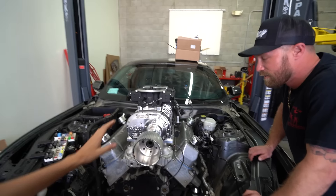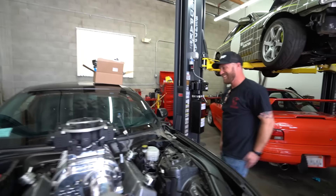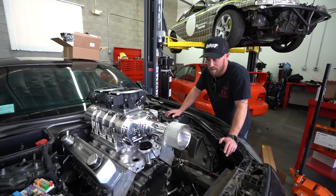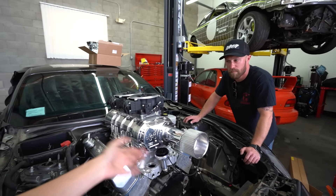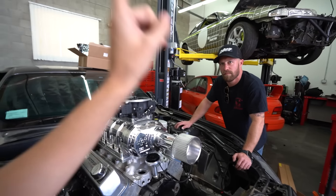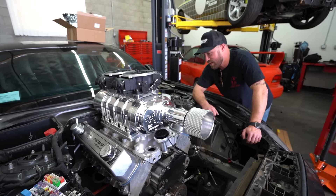This is not sus at all. I've grown to really love and get so excited for this build, and I realized I just don't like stock cars. How much power is this supposed to make? We're shooting for 2,000 horsepower. On this bottom end, I think we'll make 1,500. It's fully built — an SVO block based off the 460. It's a 598, so it's basically 600 cubic inches, twice the size of an LS. Forged crank, H-beam rods, aftermarket pistons. It's got a high compression ratio, so that's why we're not thinking 2,000 immediately under boost. We were able to do 1,200 with a higher compression ratio on the C8 with twin turbos. I can't wait to hear it.